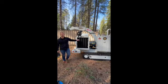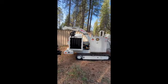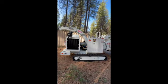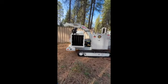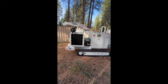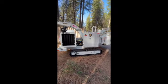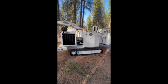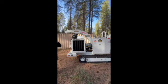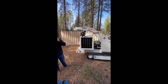I think 20,000 is conservative for this engine. Yes, sir. Just one quick tip on that whole thing about that air filter. If you're going to commit to opening that, then commit to replacing it. Because if you start to open that thing up, look at it, mess around, tap it, then put it back in, you can't guarantee that you didn't just put a whole bunch of dirt between that filter and the intake. So if you're going to commit, use that indicator and then say, I'm changing that air filter out today because it's part of maintenance, and you open it, wipe it out with a rag, put a new one in, and don't put it back in like that. It's just like the rest of the Bandit filters, where it has one internal, one external.